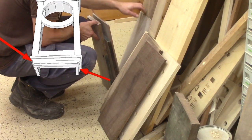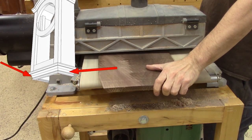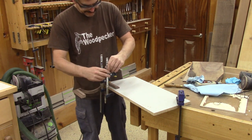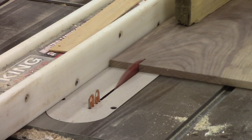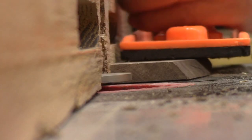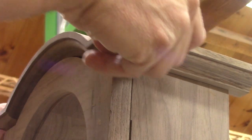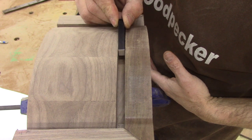While this dries, I gather more walnut for the bottom decorative stack of moldings. Surfacing all this takes so much time that I'm now able to glue the other side of the top arch molding. Now I need to route all the shapes for all the pieces of all the bottom moldings and rip them to width. The bottom molding needs a groove so I'll be able to close it with a very small panel. If you look at the top molding, you can see that on the side I have a reveal of about a quarter of an inch, but not on the front. I need to push the molding forward, but doing that leaves me with a gap — and yes, this was planned in advance. I measure the gap and sand the piece that I mangled a bit while doing the OG.